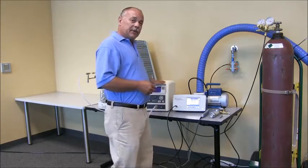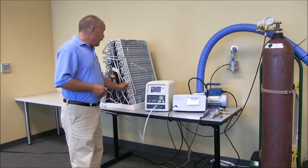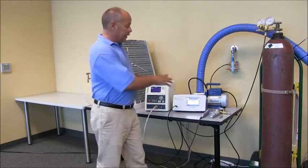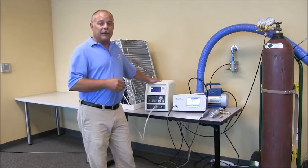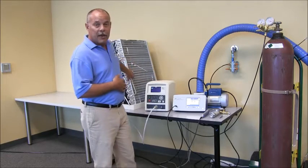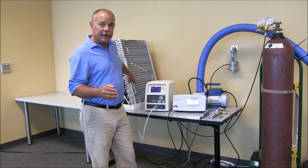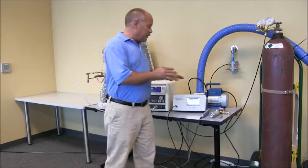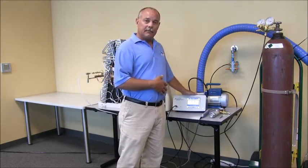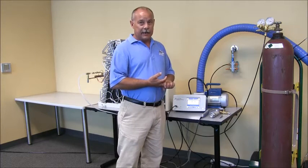Today for this demonstration I've chosen an A-Coil. We are by no means recommending this leak location system to find a tenth-of-an-ounce-per-year leak, which is the typical leak rate specification for this product. This product is typically leak tested upstream with a gross leak test, so this system is suitable for anything detectable with a vacuum decay, pressure decay, or mass flow technique.